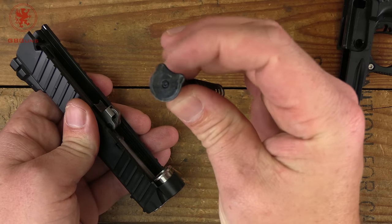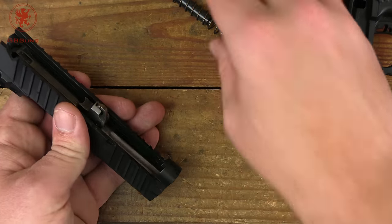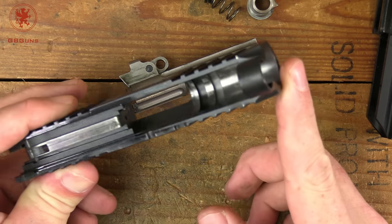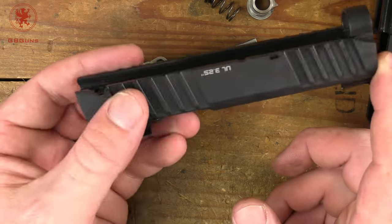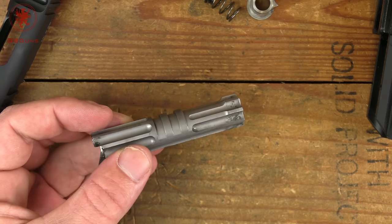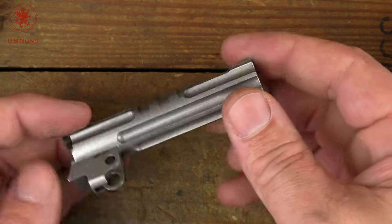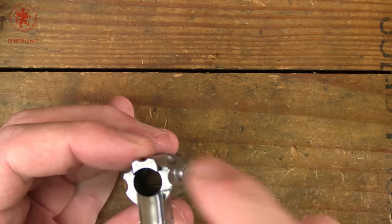Note the Mickey Mouse or bear face on the spring — that curved part is what sets up against the barrel. We have a bushing here with the same curved part. Tilt that piece forward and your barrel, once unlocked, will slide out the front. Take a look inside our slide — you can see nice shiny stainless where there are friction or contact points, and everything else coated. This is a 70-series gun, meaning it does not have that drop-safety plunger in there. After a quick clean-up of the barrel with a rim wipe, look at this brilliant fluting — there's a thicker part left to serve as a bushing for this bushingless 1911 design. Nasty polished feed ramp, and there's the cutout that allows room for the extractor, so you're not banging the extractor against the barrel.